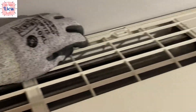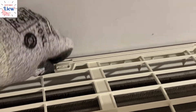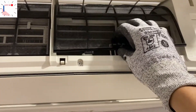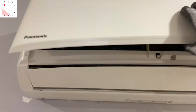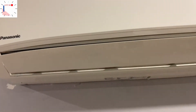Make sure the notches up here are aligned properly and fit into position — push it inwards until it fits. It's good to wear safety gloves to prevent your fingers from being injured by the coil inside while pushing the cover back. Lastly, install the air filter — clean it, dry it, and install it back. Then install the mounting screw in the middle and at both sides, and close the caps on the left and right. It's done.